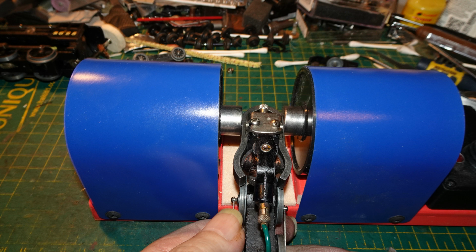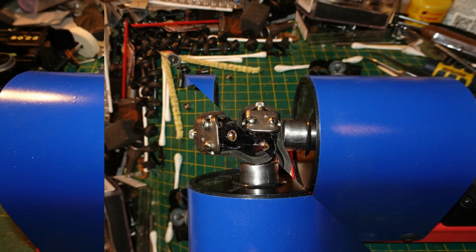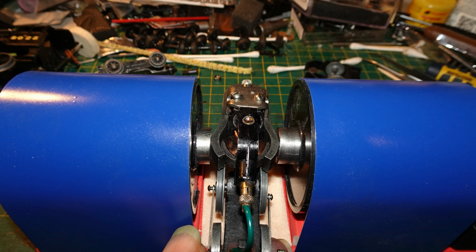Ronald Dodds, the maker of the remagnetizer seen here, specifically recommends a special procedure for these horseshoe magnets. Since they tend to be weak, he recommends zapping them with the magnetizer at 3 positions. First at the back end, then at the center, then for a final burst of about 5 seconds at the wide end by the armature.